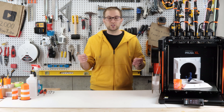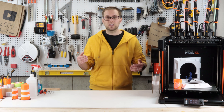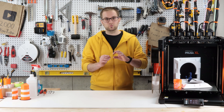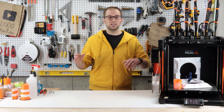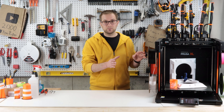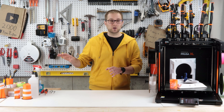I also really appreciate that I thought I needed to replace more parts, and the Prusa support person I was working with had me do a couple of simple mechanical checks and fit checks, and determined it was really just the linear bearing that was bent - the rest of the heat bed assembly and the heat bed supports were fine and didn't need to be replaced. So thank you Prusa support for helping me fix my assembly mistake and for making sure I didn't waste money buying extra service parts that I didn't need.